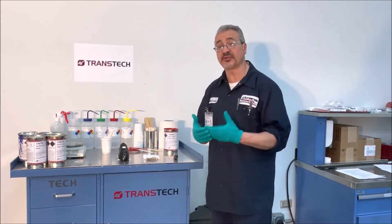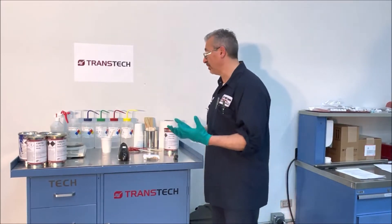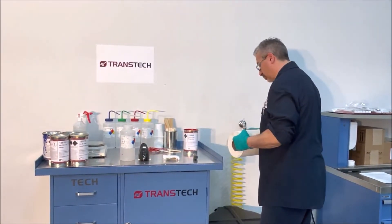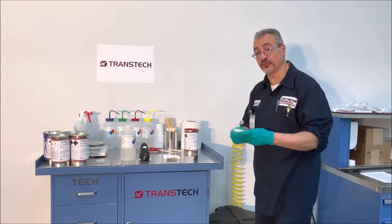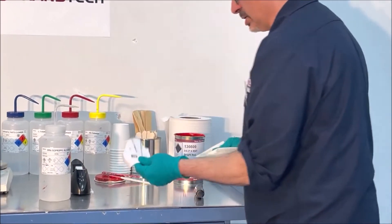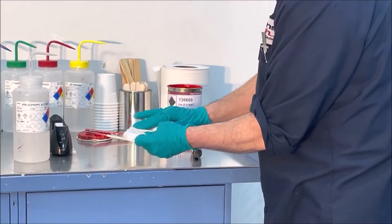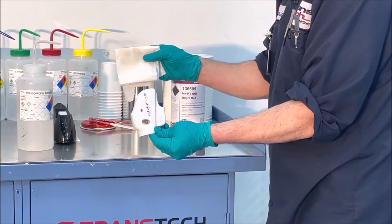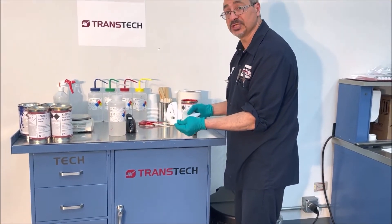What we do is use methanol alcohol or 99% isopropyl alcohol. If this were a UV printed part, I take my paper towel — I like to fold it into a nice square — and rub it about 10 times with some light pressure. If there's nothing on the rag in the color of the ink, then you're good — nothing rubbed off. Pretty much this confirms the ink is chemically resistant with the UV being cured.